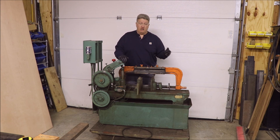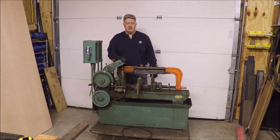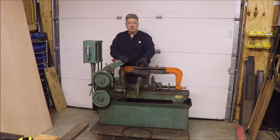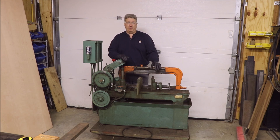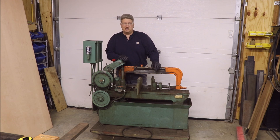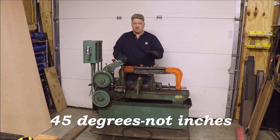Actually by twice the speed, which is the reason why I acquired it, because I've got some big structural steel members - 7 inch rounds, solid steel - as well as some 8 inch by 12 inch and some 6 inch by 8 inch structural steel for an upcoming project which you guys are going to see, that I need to cut to length. The saw also does miters. The fence here can be set at 45 degrees. It reduces the width of the cutting capacity but still has a pretty nice 10 and a half inch cutting capacity at 45 degrees - 8 inches by 10 and a half inches.